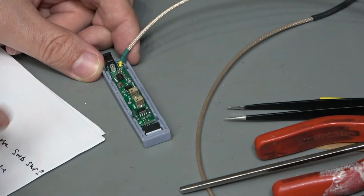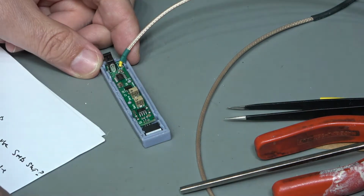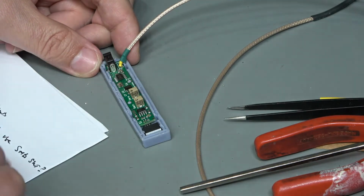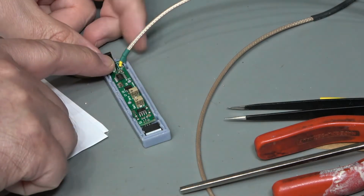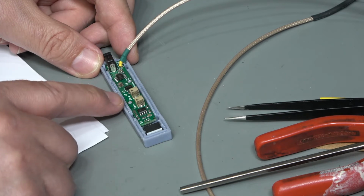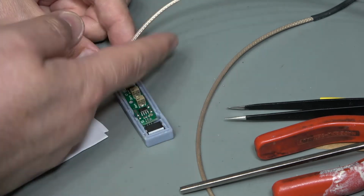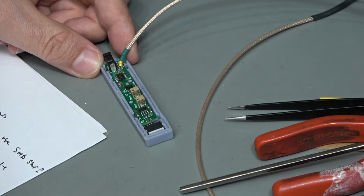First of all, the DC jack socket tends to skew a little bit, and that just means I should put a bit more clearance around that. The cable, I'm really not happy with that mounting method. So I'm going to put over here something like maybe an SMB. Let's see if I can find something even smaller than SMB that will go onto this cable size. This is a 2.5mm diameter cable.